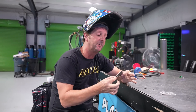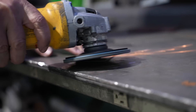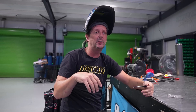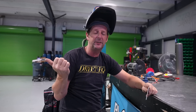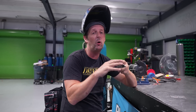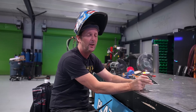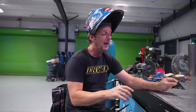Before you set your welder settings, you need to know the material and thickness. I'm using an eighth-inch steel plate against 14-gauge mild steel. You add those two together — if you're joining two pieces of eighth-inch steel, it's technically a quarter inch, so you turn your heat up higher than you normally would for eighth-inch alone. You want full penetration, not just a surface weld. Surface welds aren't strong — they will break. Dial in your machine so you're not over- or under-torching the metal.